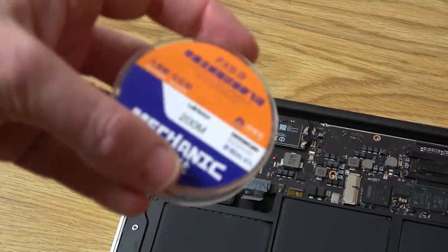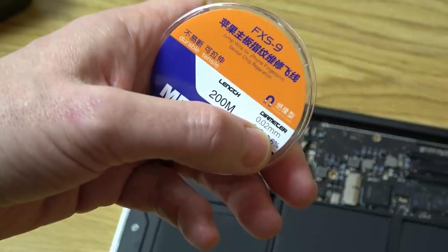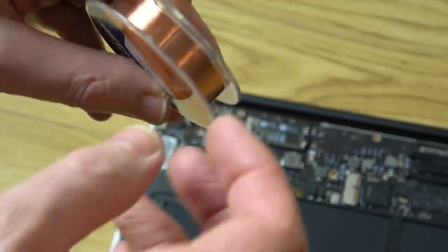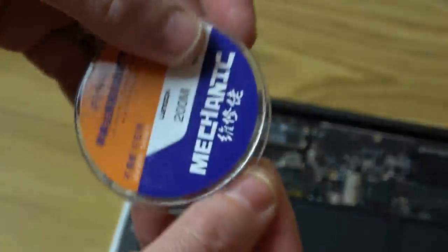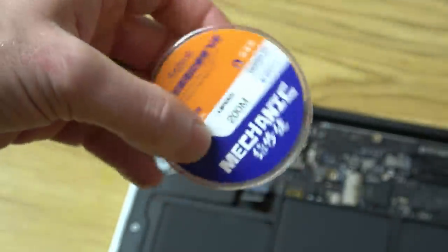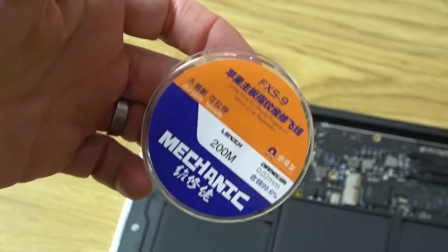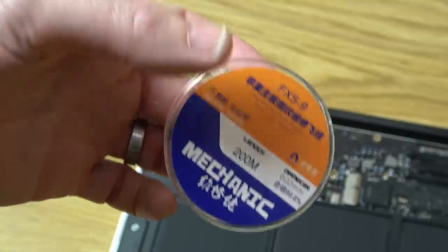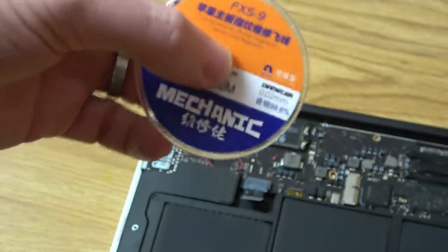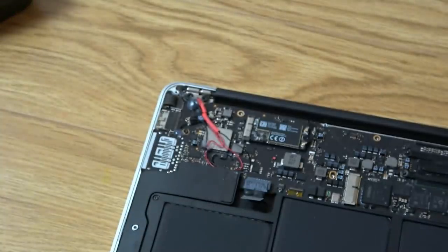So what I've done, which is wrong, is I've just got some 0.02 millimeter wire, which is tiny. This stuff you can barely even see. And I've jumpered the fuse with this stuff. Now, although this is going to blow a lot quicker than, for example, 1 millimeter wire, I'm pretty sure it would still blow way after a 32 volt 3 amp fuse. So if this does work now, of course I'm not going to leave that. That's purely to see now if it's going to work or not.